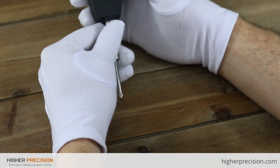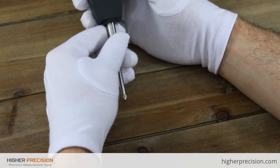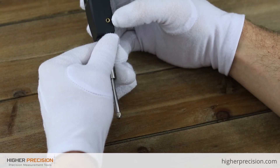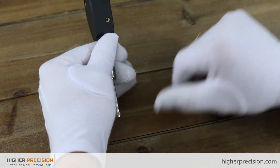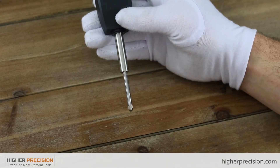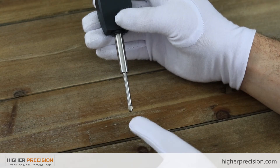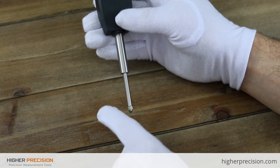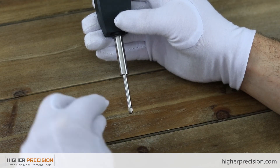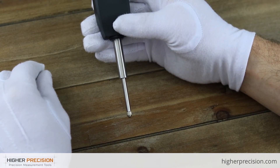For those that want to know how to automatically raise the spindle, there are two different options. There is a port for the spindle release cable — by plugging the cable in, you can just hit the button at the other end and it will automatically raise up the contact point. Or for those interested in a simpler approach, there is a C-hook: you fully remove the contact point, put the C-hook clamp in between the contact point and the spindle, then reattach the contact point. From there you have a little C-clamp that you raise up and down manually to raise and lower the spindle.